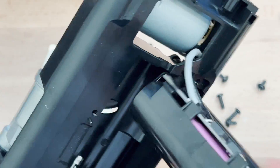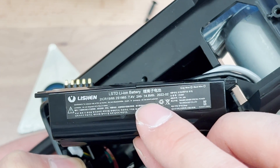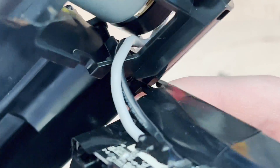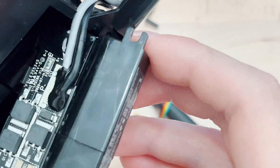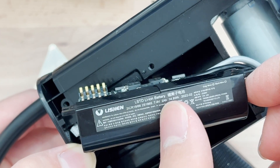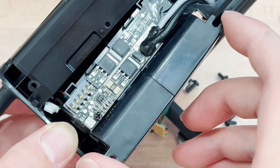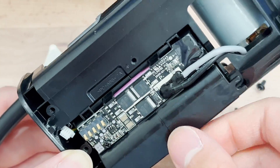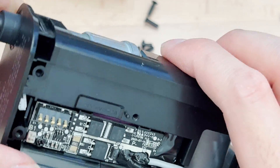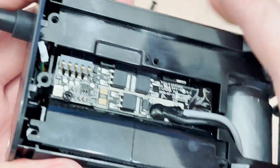This is a really nice battery, actually. This battery pack seems like a part they actually had OEM'd for them — this isn't just some random lithium-ion cells they had lying around. I'm probably not going to take this apart more because it'd be difficult to put back together given it's all spot-welded. But this is 7.4 volts, 2 amp-hours, 14.8 watt-hours. I'm just surprised they're using something like this, because a $40 pump of about the same size can't possibly be made with this much attention to detail. This is why I sort of like these Xiaomi products.